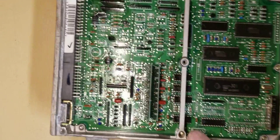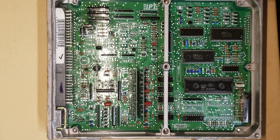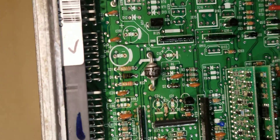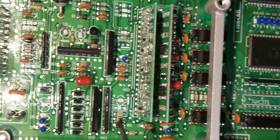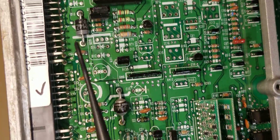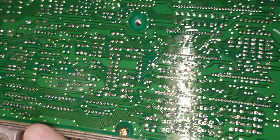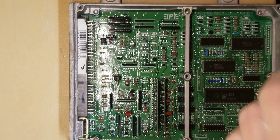Welcome back everybody. This is part two of Honda Tuning 101. We're going to start to install the new capacitors to make sure that we have a solid ECU. As you can see, they've all been desoldered nice and clean, everything's been cleaned up with isopropyl alcohol pads. We checked out the back of the board — this is a P06 ECU that we're going to turn into a P28 — everything looks good back there, so let's get the capacitors in.